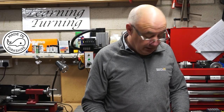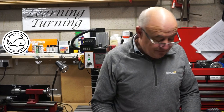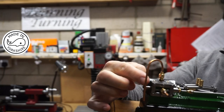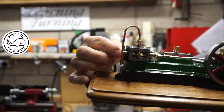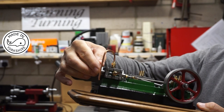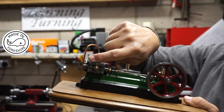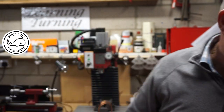What I found most difficult was drilling the hole in the far end of the valve chest — just in there. It should be a blind hole. I think where I went wrong was that the inside wasn't perfectly flat before I started to drill through. So next time I'll make sure it is flat.